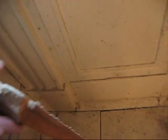I did learn something: the bottom piece is an inch thick, it's grooved, and the top piece is also grooved — this groove goes down into it. So this top piece has to come off and lift up in order to keep from doing what I did here, which was cracking the groove out of this one. Knowing that gives me a head start getting the rest of this off. I know that top piece has to come out and lift up, so I have to get the nails out of it and then I can pry down the other piece. The other good thing is that once this outside piece is gone, it looks like I can come from the back side, put a piece of wood against it, and hammer the molding on the other side of this wall out. Working from the back side should make it a lot easier to get this molding off without wrecking it.